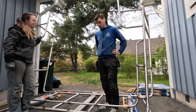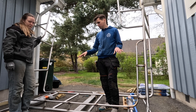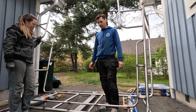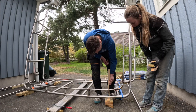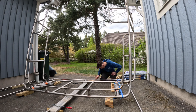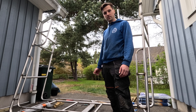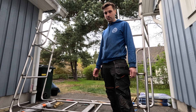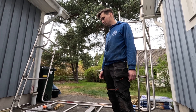Another day and we're continuing with the solar arch. We've been struggling quite a lot with getting everything in position, especially trying to position the frame that's going to hold the solar panels in relation to the arc. Ideally you'd have a big flat welding table, but we don't really have that. We try to make everything flat and measure it with our laser, but it's very difficult. Our tolerances are quite small because the panels have a quite tight fit in this frame — if we don't get it right, the spacing between the panels and the frame won't be equal.